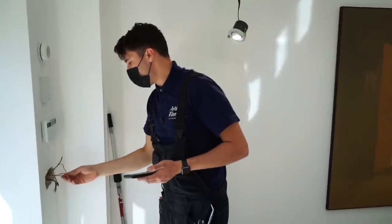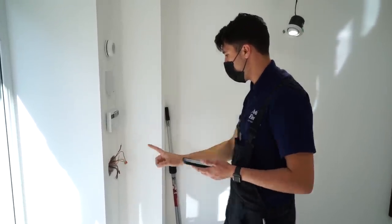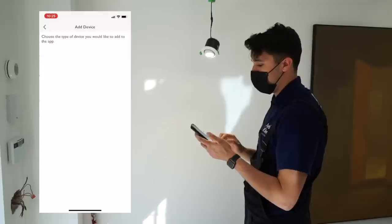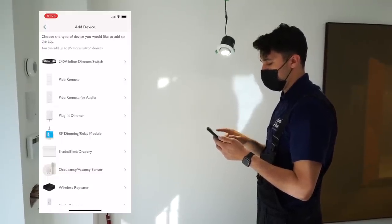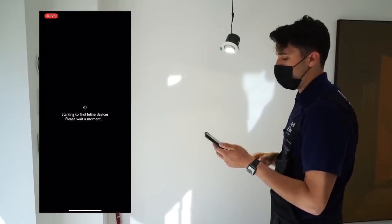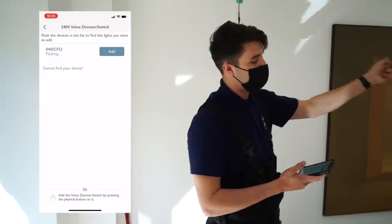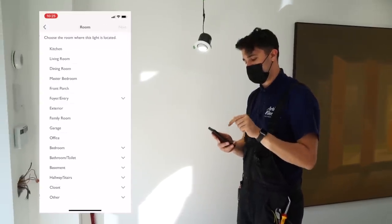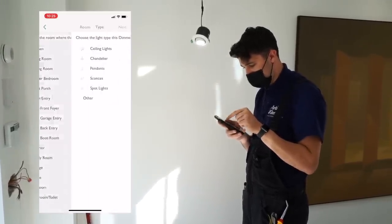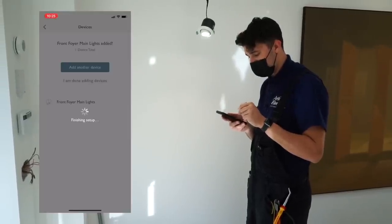We've got all the feeds fed through, just temporarily WAGOed. All these cables are not needed anymore and are dead - I've got a WAGO temporarily linking them. I want to find this on the app, so I do 'add device' - 240 volt inline dimmer, find dimmer switch. Because this one hasn't been paired to any hub, it should pop up. I'll flash it and it will flash all of these lights to confirm it's the right one. I'll add to the system, select foyer entry, front foyer, next - ceiling lights. Done adding devices.